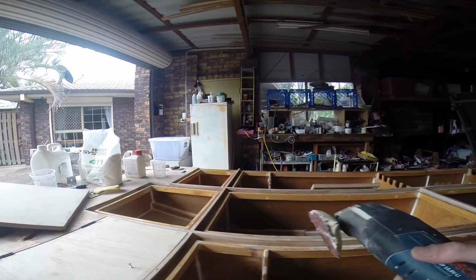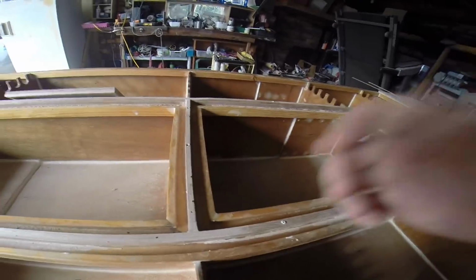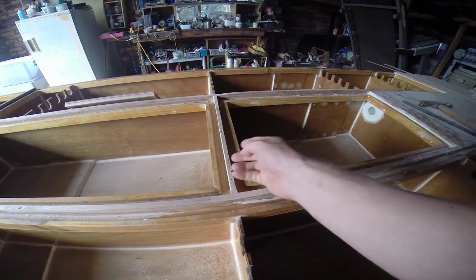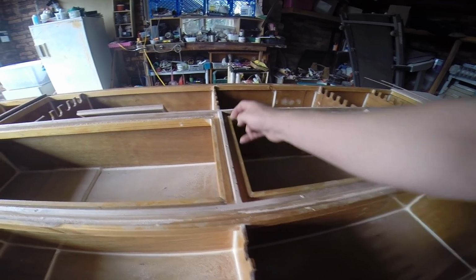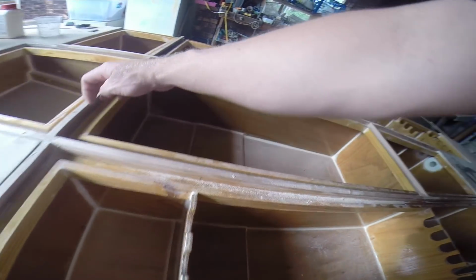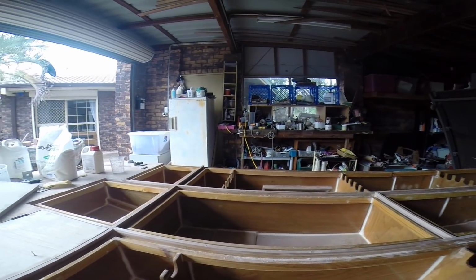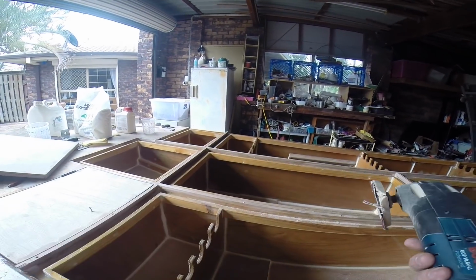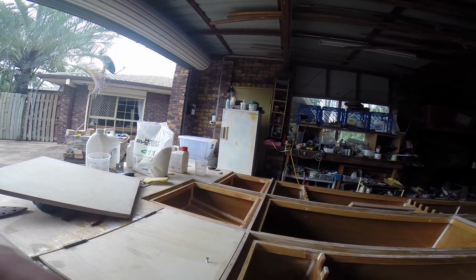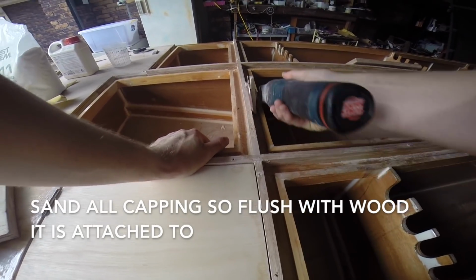Once that's done, then we can work out what parts need to be chocked, like here. So I've worked out that I need a little chock in that side. So I'll stick one of them in there, sand it back till it's the right width. That side's all right, so that won't need a chock. Haven't checked this one because I'm gonna have to remove all the coat, all the excess around these sides. First job, remove all the excess, and then we can work out which hinges need chocks and which ones don't. And then I can show you how to do that. So let's get into it.